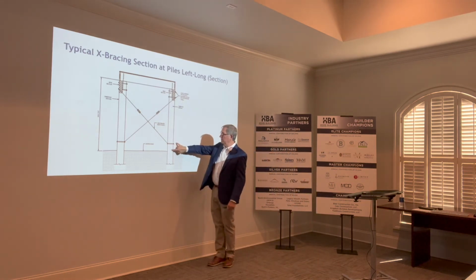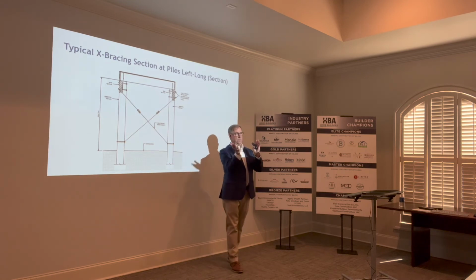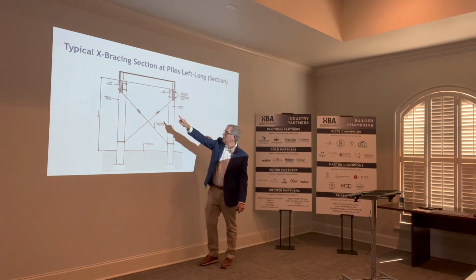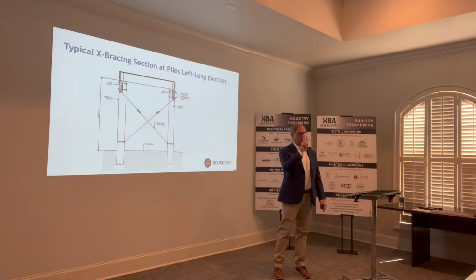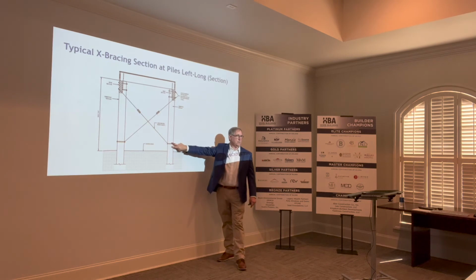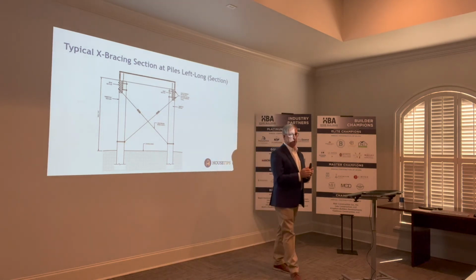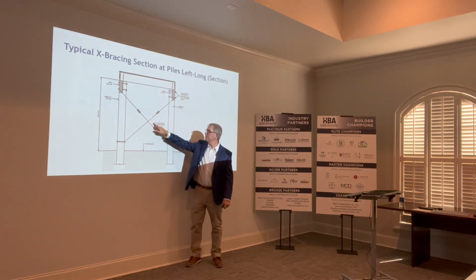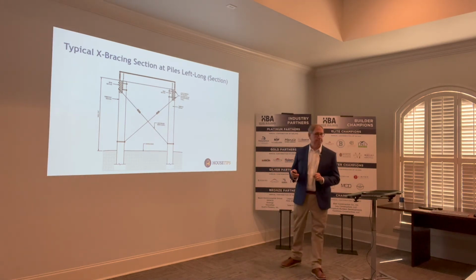Again, if you have, say, 2x12, 2x10, 2x8, whatever it may be, cross material, they're usually on each side of the pile. Okay, so let's say front face, back face. You follow me? Two bolts required at each one of those connections, not one. If you put one, the whole thing can pivot. You put two bolts here, you lock this member coming in here. You understand what I'm saying? And you can also catch it on the back side and bolt it together, lock it up tightly. And then you'll probably need a spacer in between here with your 2x material, the width of your pile. Follow what I'm saying? Questions?